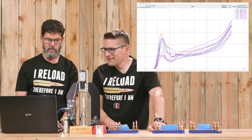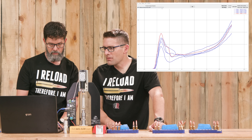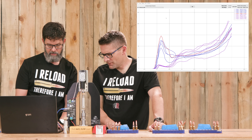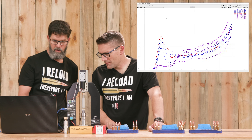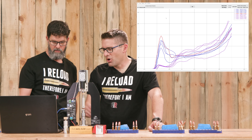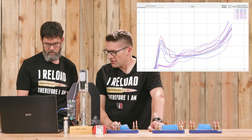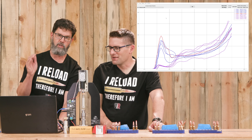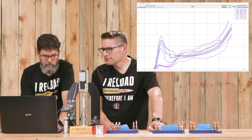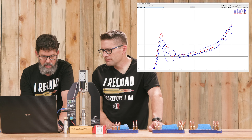Taking into consideration the brass we're using here. This is annealing — look at how the initial spike is almost completely collapsed. There's a tiny spike but it's been reduced way, way down. Very interesting — so this is the control group versus annealing. Now we'll do the control group with all tests combined.